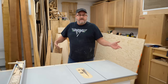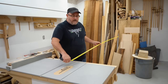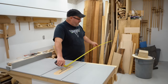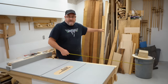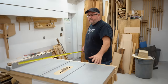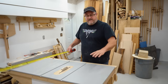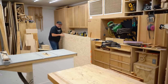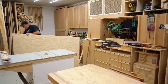So you're not going to get the most accurate cut doing it that way, plus it's kind of difficult as you'll see coming up. The first thing I do is take my tape and measure back to see if I actually have enough space for the cut — and it looks like I do. The stuff piled up down there doesn't come far enough ahead, and the outfeed table for my table saw is my workbench, which is completely clear. That's very important: you want to have the area clear before you turn on the saw. You don't want to stop partway through the cut and try to move a bunch of junk out of the way.